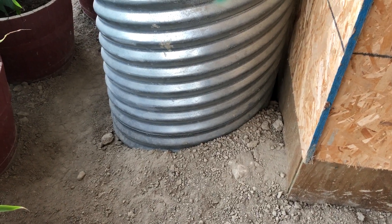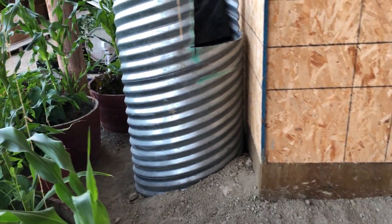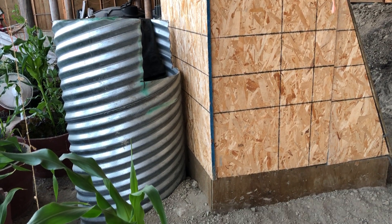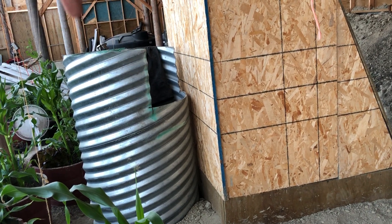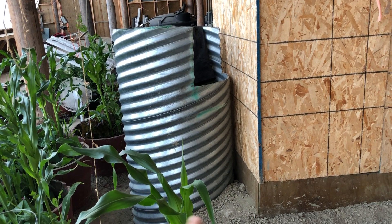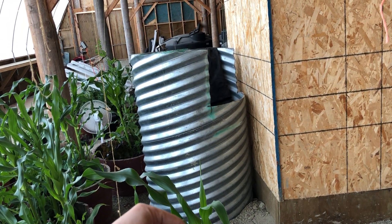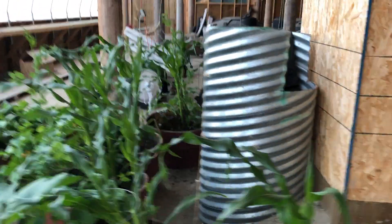This is a cool feature — I dug this well by hand. It goes down about 10 or 12 feet, basically all the way down to the water table, which allows it to be used as a dewatering well if the water level ever gets too high and starts to interfere with the subterranean heating and cooling system pipes. I've also been debating using this as an additional heat exchanger by pumping hot air down a separate tube with some wicking cloth for evaporative cooling like a swamp cooler, with a second pipe in the center and the air returning up the annular space.